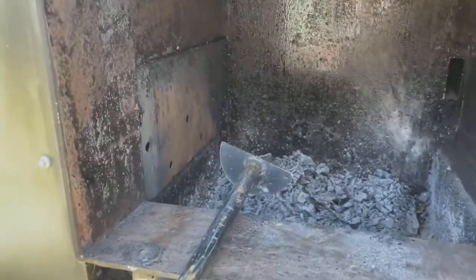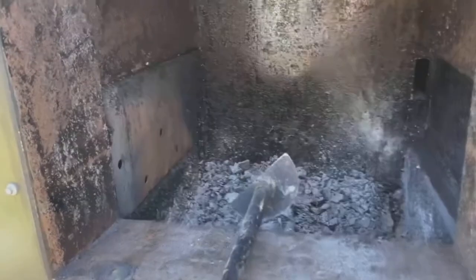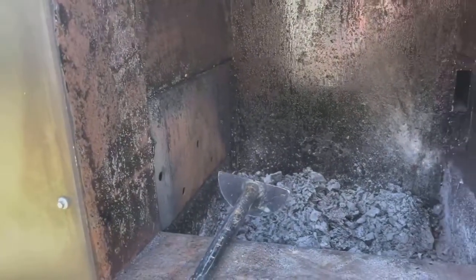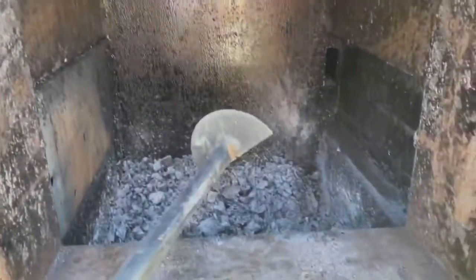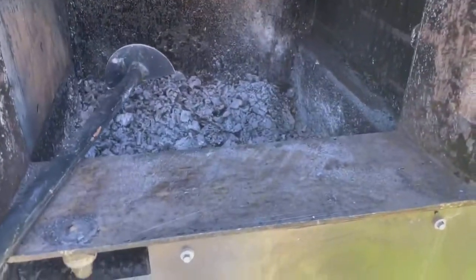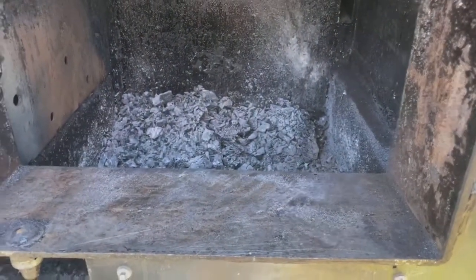And the supplied ash tool, this is actually for my 7000. That's how I break the side panels loose. Give them a hard wrap. That creosote will let go. And during the season, I also use that same tool to keep the door flange scraped. If you keep that clean as possible, the water can run away from the seal instead of down the front of the stove.